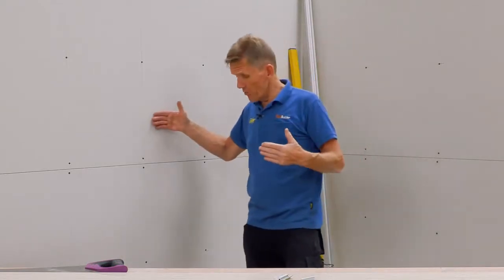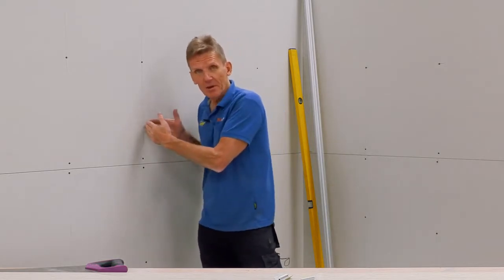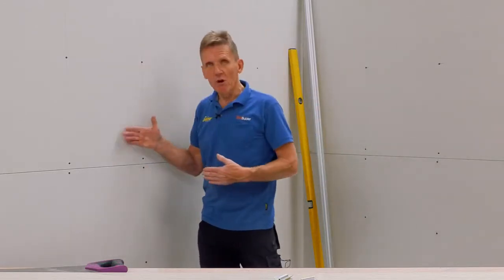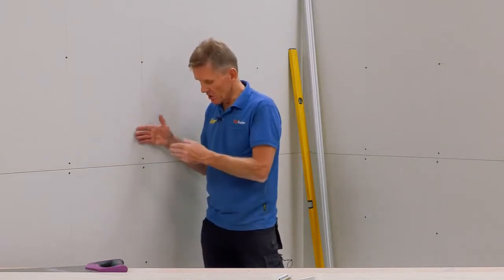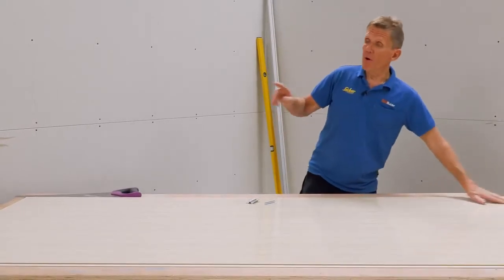It's very important that when you put your shower enclosure up and you put the profile onto the wall, this panel goes behind the profile, not butting up against it, because I've seen that many times when people do that with tiles and they get leaks down the back. So run that panel right behind, all the way up to the edge, or even oversailing the edge slightly. Then you can put your profile to the corner. So once you've worked all those things out, you've got sacrificial ends on both ends of this panel.